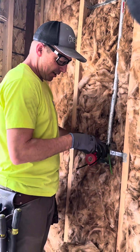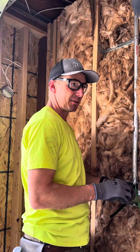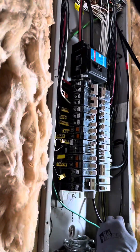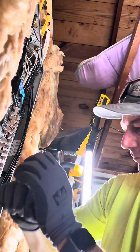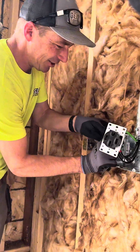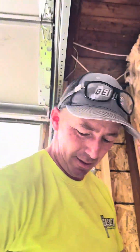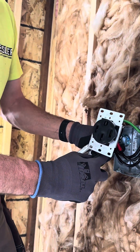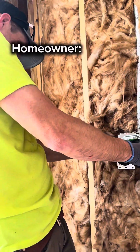I didn't designate my neutral, and I know this is red tape — you're only supposed to use white or gray for a neutral — but I'm about 35 minutes from a parts store. This is that KO filler I was talking about. You just stick it up to the hole and shove it in there, and if you want it to be a little tighter you can just take a screwdriver and bend these out — it stays in there good.